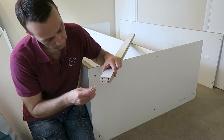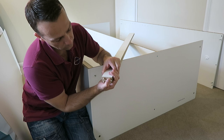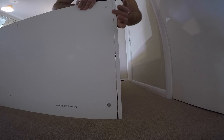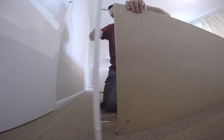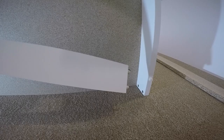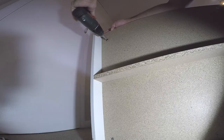These are the two slim panels which go under the bottom panel. One is white on one side and raw MDF on the other; another one is just raw MDF without the white part. The raw one goes in the middle and the one with the white goes on the bottom. Place the other side panel — top in first, then the bottom, but don't go completely in yet because we still need to place those slim panels. Secure the top, twist the locks, and before you secure the bottom side, just place those slim panels in. The white side will face the front of the wardrobe; the raw one goes in the middle. Secure the last side, connecting with the middle panel at the bottom, and secure the locks — it's all done.